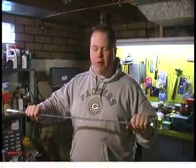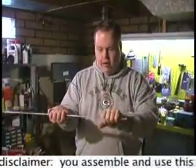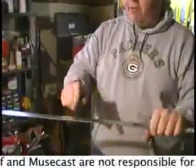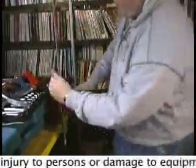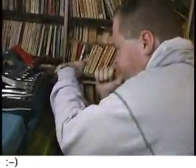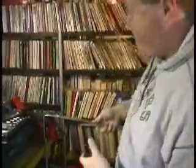The aluminum bar is your inverting bracket that will hold your camera. Your camera's going to sit here on this part, and it's basically going to make a C shape. I've marked it here and here for the height we're going to want, so we're going to put it in a vise to bend it. Aluminum bends very easily, but it's sturdy enough that it will handle the weight of the camera and will also act as a little bit of a shock absorber so you can still maintain those steady shots. This doesn't have to be exactly perfect — it just needs to be functional.